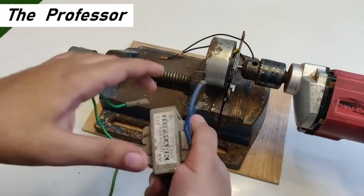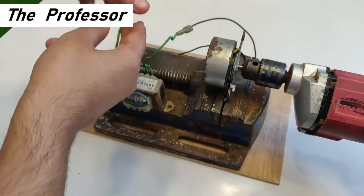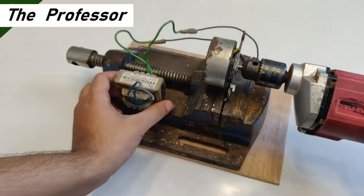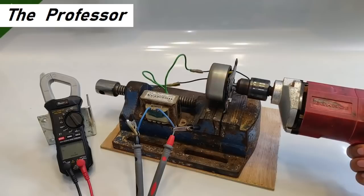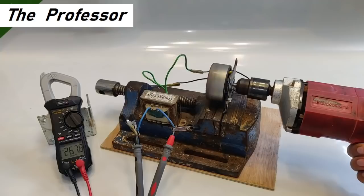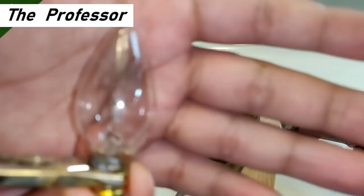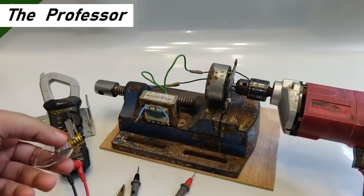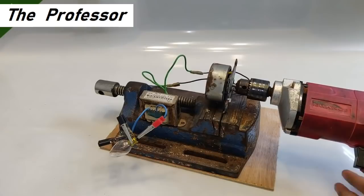This is a 12 volts to 220 volts transformer, so I'm going to use it to step up the single-phase AC output voltage from this generator to 220 volts so I can also run 220 volt appliances. The blue terminals are the high voltage winding. I've pointed the meter to AC voltage measurement mode — it was almost 270 volts AC. I also tried a 220 volt incandescent bulb and it lit up successfully.